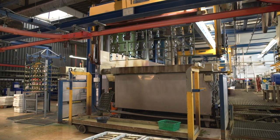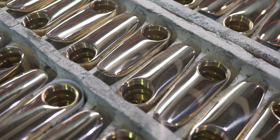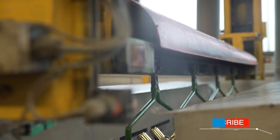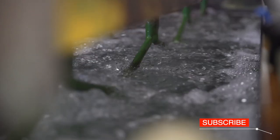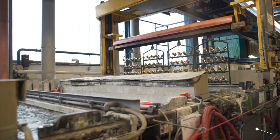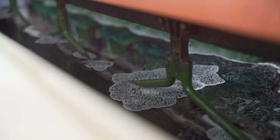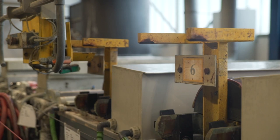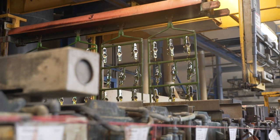The carefully polished fittings are sent for galvanization where they are covered with decorative chrome. The entire process is computer controlled. The fittings are submerged into baths filled with special chemicals. They are first cleaned and degreased, and then covered with a nickel plating. This thin nickel plating, with a thickness of 8 micrometers, provides a base for the chrome. The nickel hardens the brass surface and provides a good foundation for decorative chrome plating. The chrome makes the fittings smooth and influences their final appearance, and the fittings are chrome plated to a thickness of 0.25 micrometers.